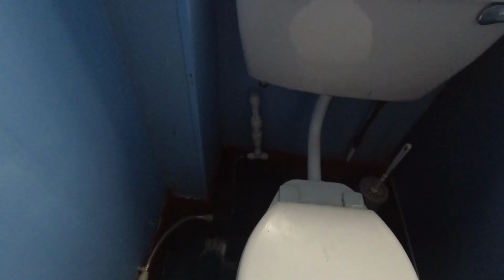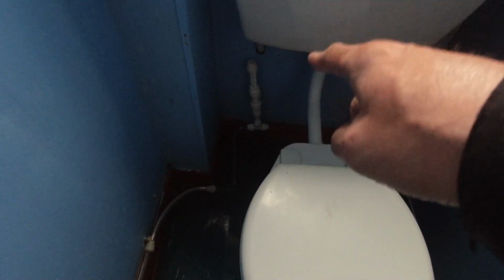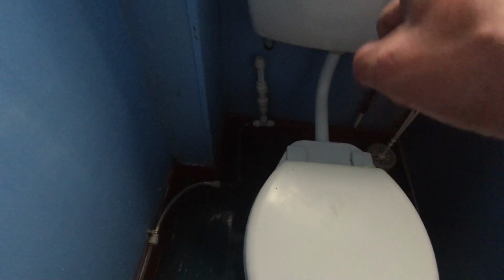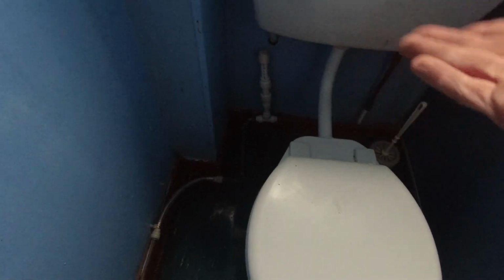So down here we have, I don't know if you can see that, we cut the 15mm pipe and put a T-piece in, and all that rigmarole on the top of it is because we ran out of 22mm elbow joint. So I've used a 22mm T-piece, a wee bit of PEX, and then I've put a stopper on it. So it's essentially an elbow joint. And the idea is that this now feeds this whole system.